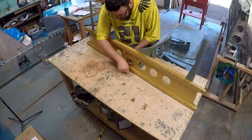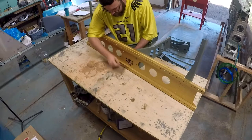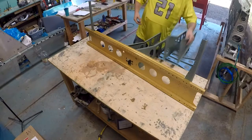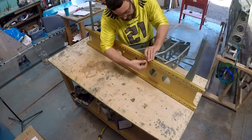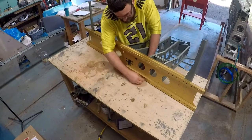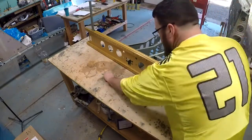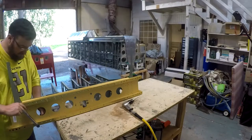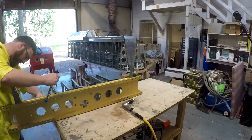So we're starting to get caught up with where I actually am. What you see me doing here is attaching what I'll call the seating ribs — I've been calling them baggage ribs, but these are actually where the bottoms of the seats are going to attach. I'm screwing and bolting them onto the wing box frame, and you'll see me in a minute going through and torquing those down. These are all size three bolts, somewhere around 25 to 30 inch pounds.